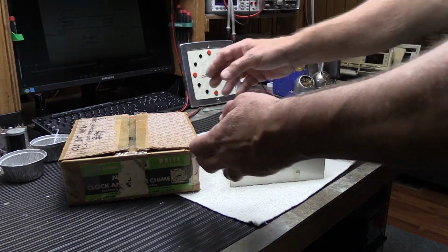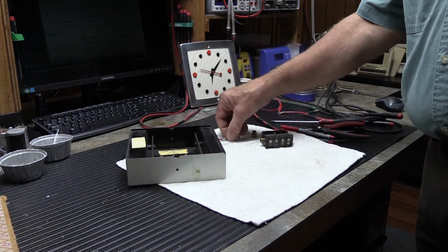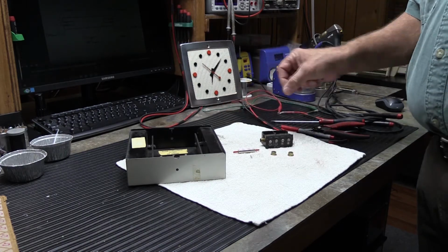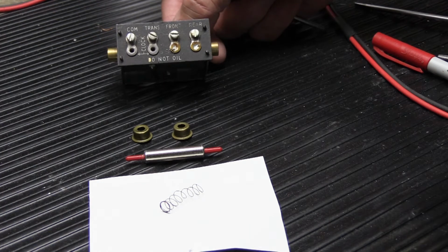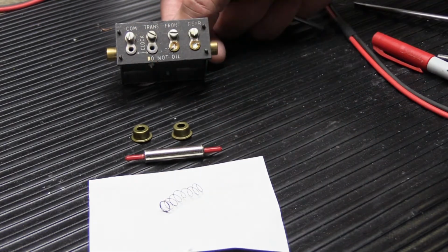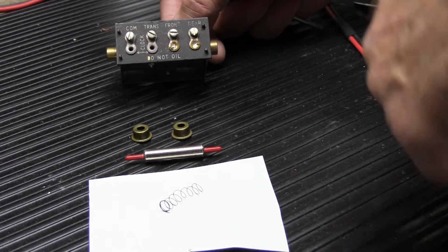What's our task here? Well, our task is to reassemble the chime. These are all the parts, so it rings properly again. And it's got a little bit of a problem. This K or L35 door chime has a fairly typical NuTone two-note power assembly. This is a variation on a standard one because this is a model with a clock. So you have extra terminals where the clock plugs into it for power, and then you have front door connection for two notes, rear door connection for one note.